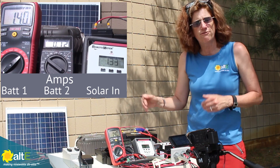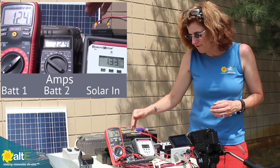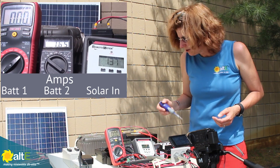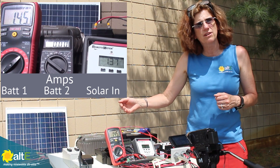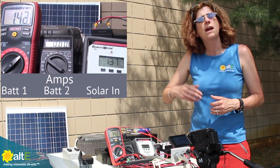This is all happening very fast, so you might not be seeing it in real time. It's at 50% — I can actually go in and change it to be 90-10, so it's going to stay on one battery longer for 90% of the time, then switch over to the other one and go back.